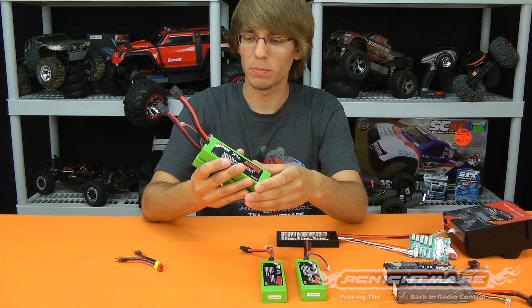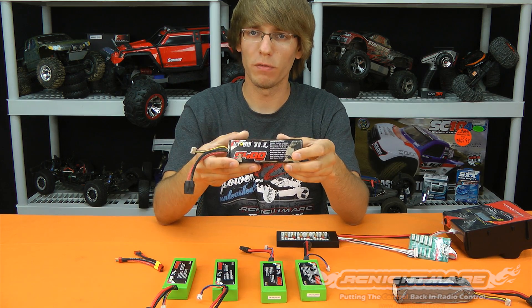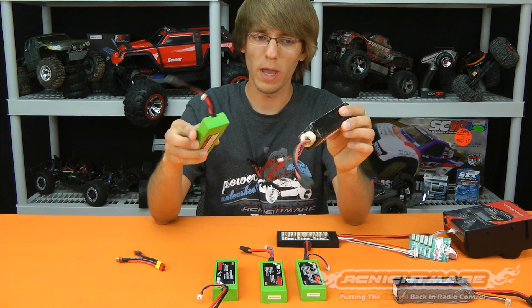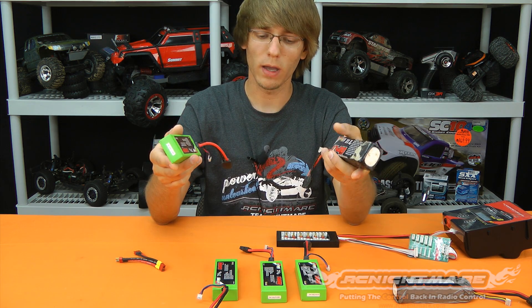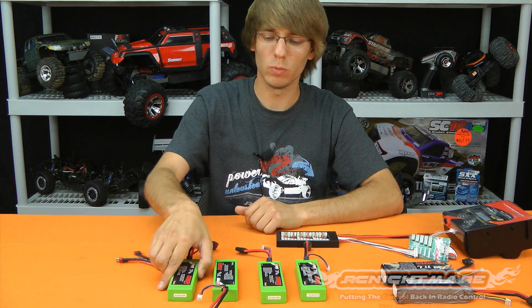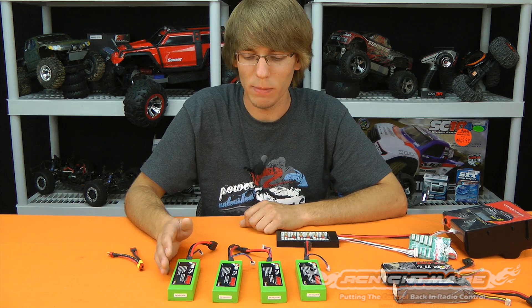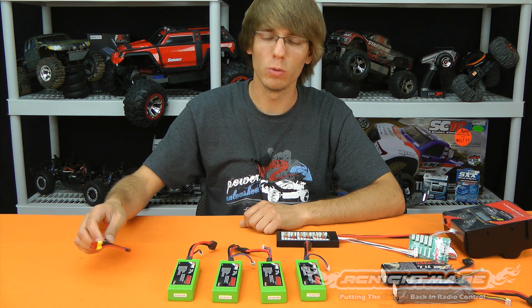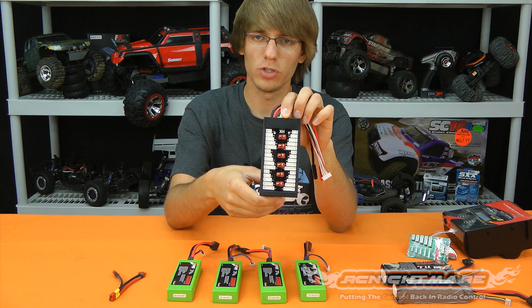Keep it to parallel. You can't parallel two different types of batteries. Here I have a 3-cell 5.4 amp hour pack — if I try to parallel charge it with a 2-cell, the voltages don't match: 11.1V versus 7.4V. They'll burn each other up and you have a potential fire or damage the smaller pack. You can only parallel charge packs of the same cell count. Ideally you also want the same capacity — parallel charging different size packs is possible but gets more tricky.